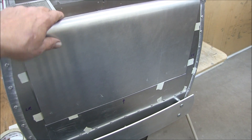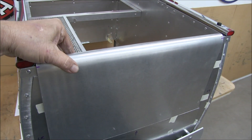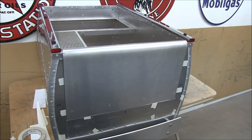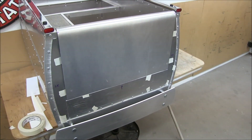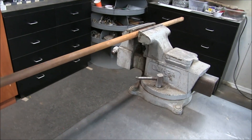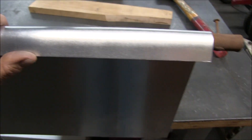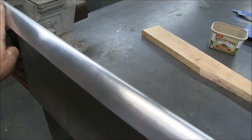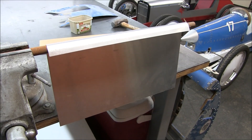Here you can see the first trial fitting of this tailgate piece. I'm hand-forming this over a pipe that I have out in the vise — a little bit more work and it'll be where I want it to be. It's got to lay down more back here but it's coming along. I have this steel rod in the vise and this stays against the table — I just get down on my knees and pull down on this thing. It's only 40-thousandths so I'm able to get it to shape without any hammer marks.